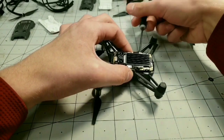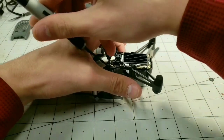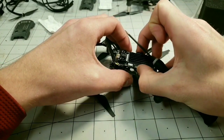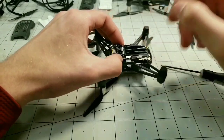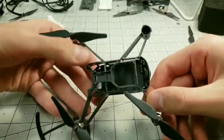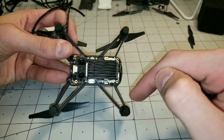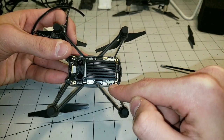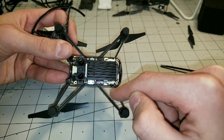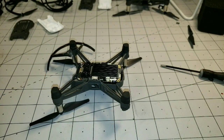So once that's disconnected, we can kind of lift this out of here to fully investigate the motors. Just very gently lift the flight controller out of the frame. Once it's slightly out of there, we can mess with it. You'll see that the motor wires are run under the flight controller. So the front motor wire looks like it's going to be right here. We're going to have to remove this little — it's like liquid electrical tape. What you want to do is just take a little razor or an X-Acto knife and just peel that back — it shouldn't be too hard.